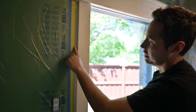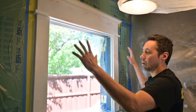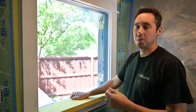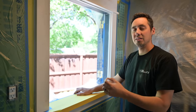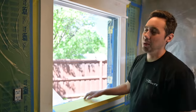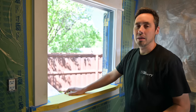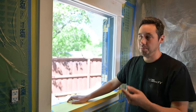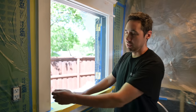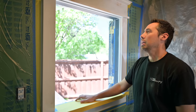What John has done is he's run his tape about a sixteenth of an inch away from what we're going to spray. We always run our tape first all around the entire project and then run our caulking. Very important if you're using the tape-caulking method where you're using the caulking as a seal to get your paint line. If you are going to use caulking with the tape, it cannot be elastomeric caulking — so it can't be Big Stretch or Shermax from Sherwin-Williams. It has to be just an acrylic type that's not going to stretch, because when you peel the tape you want just a nice clean line.